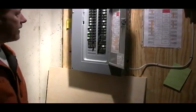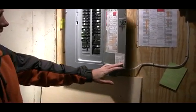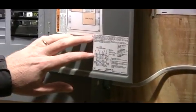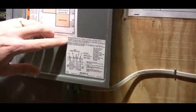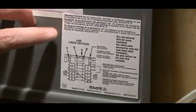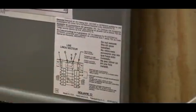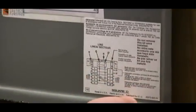I've put the cover back on the panel. The interlock kit ships with a little placard, and I like this because it says 'Generator Interlock Kit,' gives the catalog number, and says it is suitable for use in accordance with Article 702 of the National Electric Code. I put that on the inside cover, and it also has a schematic.